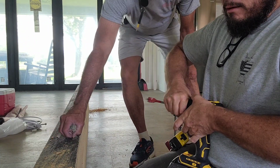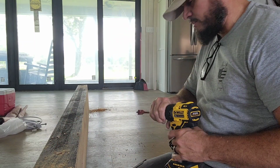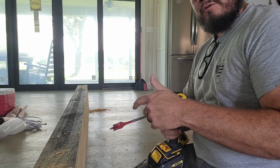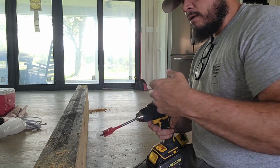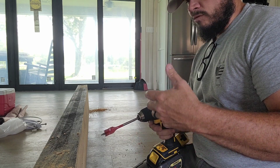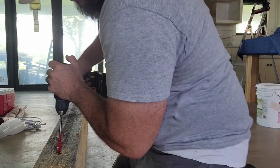Especially when you're doing pine, because there's a lot of heart down in this hole. There's a pile of just sapwood down in there. You want to make sure you got a drill bit that'll pull down into that wood, because if you don't, it's just going to bind up, and it's going to leave you a dang mess. So make sure, if you don't use Diablos, use something similar. But we just had a lot of luck with these.